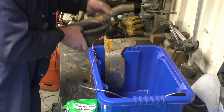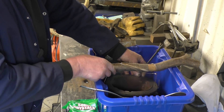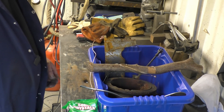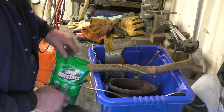This is the part I'm going to clean — it's quite badly rusted, it's the end cover off the engine, the governor cover. So I've got that hanging in there on some copper wire. I'm going to put the washing soda and soda crystals in, put some water in, and then hook it all up and see what happens.